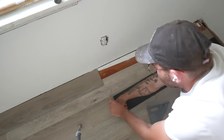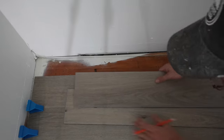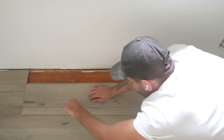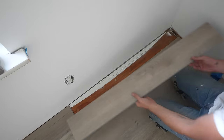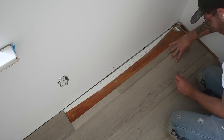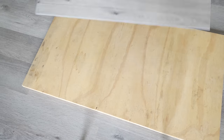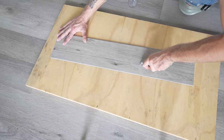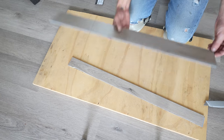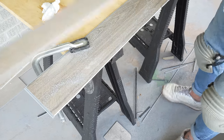To cut the taper, first get all of your pieces cut to length. Then rotate your board 180 degrees — opposite the way you'll install it — and slide your plank down so that the end you're going to cut is the same end you're using to reference and mark. This way the end of the board you're marking is also the end that'll be touching the wall when it's installed. If you didn't do this, your taper would be a mirror image of what you actually wanted. I highly recommend using a circular saw, jigsaw, or table saw to rip your planks to width, though you could score and break the piece to the right width as well — the longer you score and snap, the tougher it'll be to get a clean break.